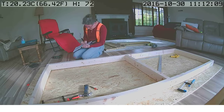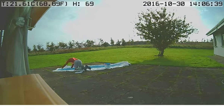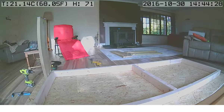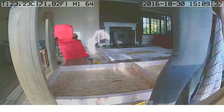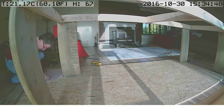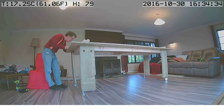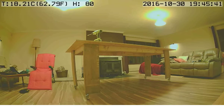This frame here is not quite laying flat on the OSB even though the OSB is on a flat floor and was flat. Some of the lumber was a bit twisted, so I tacked it down with some wood screws so it'll be flat before I put the legs on. I'd clamp each leg, make sure it was laying flat on its end, then put in wood screws to hold the legs to the frame. Then I unscrewed the screws holding the frame to the OSB, flipped it over, and traced the corners with tracing paper very carefully, then marked where the holes are in each of the tops of the legs. I also put the casters in there to make it handy to move around. Then I drilled holes through the OSB in the right places using the tracings I had made.